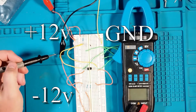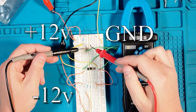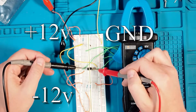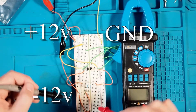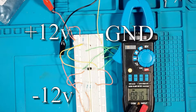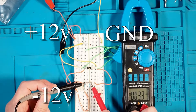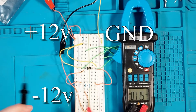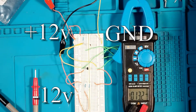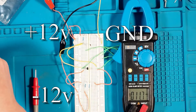This simple circuit is built to let us do just that. Plus 12 volts power comes in at the top, minus 12 at the bottom, and ground is on the right. Power flows through the current limiting resistor and a transistor to establish roughly 0.6 volts. The collectors are both connected to the positive end, the bases are connected to ground, and the emitters are connected to the negative supply through two roughly matched 100 kilo-ohm resistors. When power is applied, we measure the voltage between these two resistors to determine the output difference between the two transistors. The first transistor on the left remains for all tests, and the voltage is noted for each transistor in turn as we change out the one on the right. In this way, we compare all our transistors against the same test unit, and match the ones with the same or very similar differences to get our matched pairs.